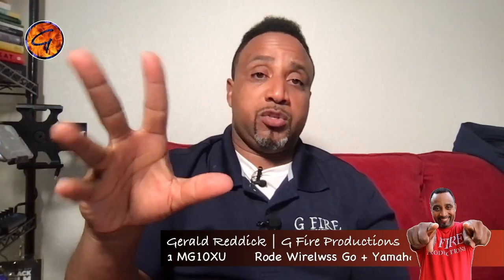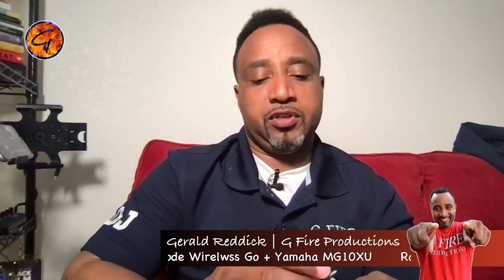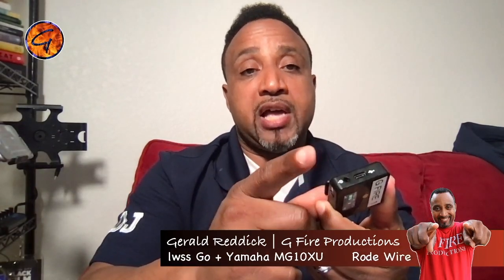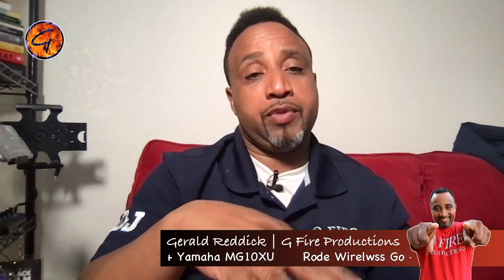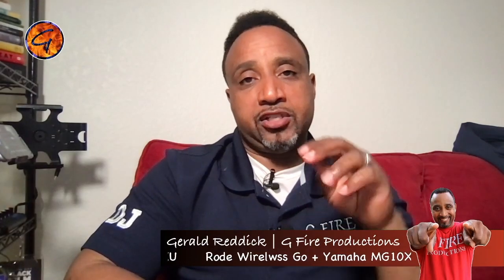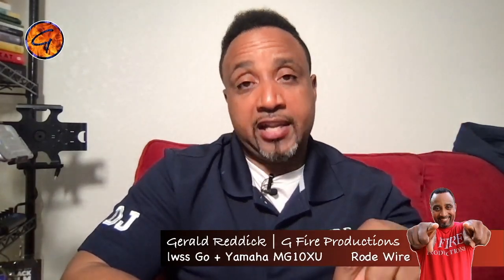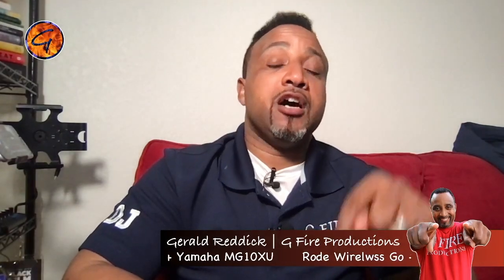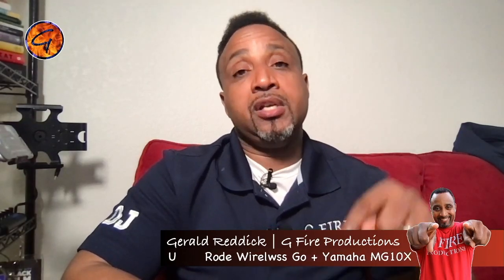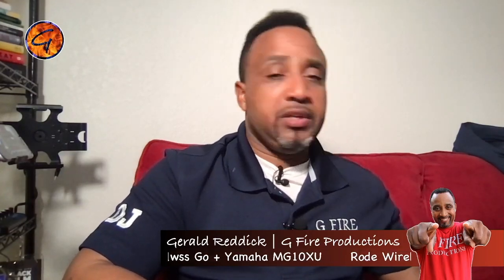And the reason why so far they didn't work is because although the transmitter and receiver both have TRS outputs out of here, so the physical connections were correct so far, but on the end and at the mixer, even though those combo jacks have 3 different connections, like you have a 3-pin XLR cable that can go in there, or you have a 1/4 inch jack cable that can go in there, what you really need is an unbalanced 1/4 inch jack cable to go down there, or you need an unbalanced XLR cable to go in that particular combo jack there. So let's talk about now the Rode VXLR, because this is what we need to make it happen.